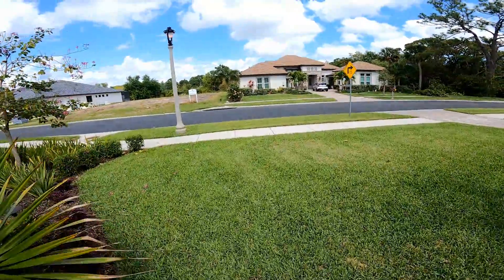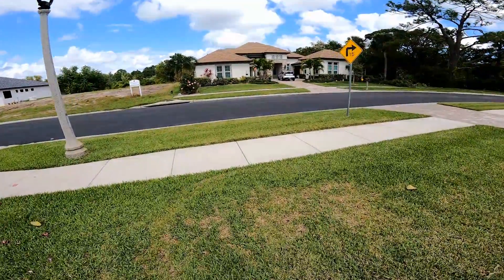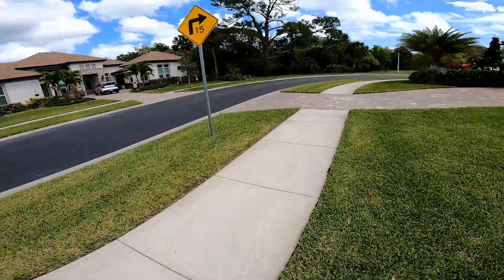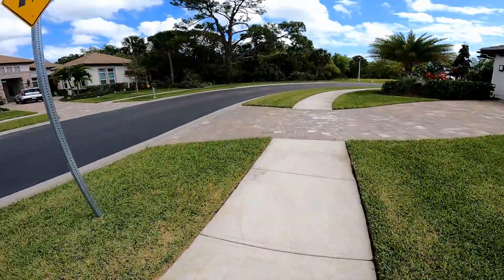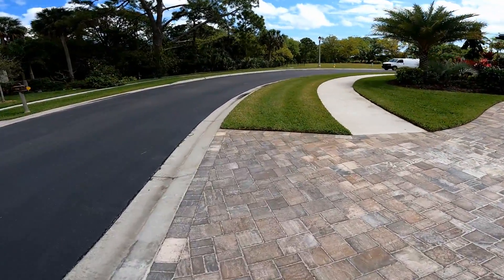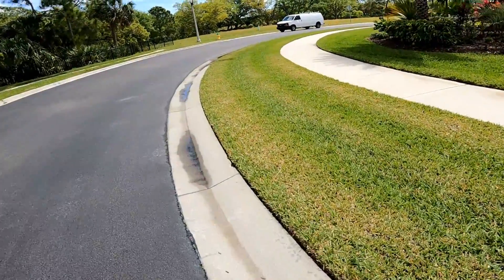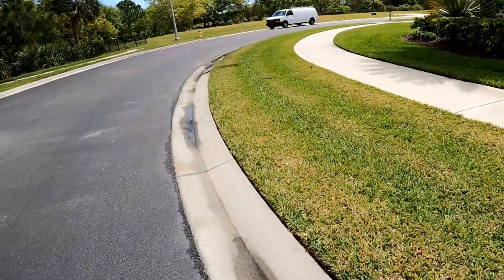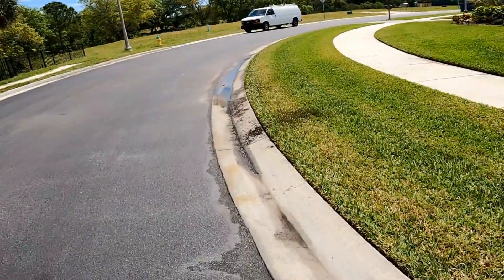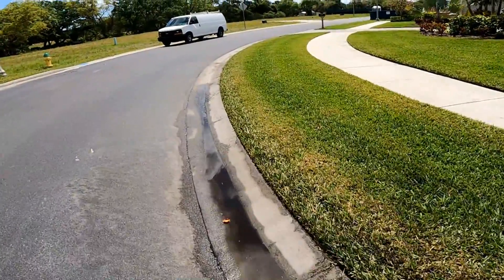But remember, this area between the walk and the street holds so much water, and that's the number one complaint. Let me walk around so you can see it. A lot of companies come out and say 'we'll put a French drain in here' — okay, question: a French drain starts 18 inches deep. Where would they discharge it? There's no place for that water to go.